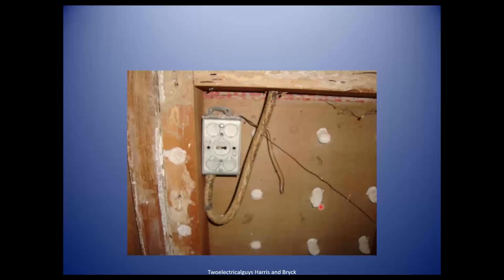This is plaster board — if you see these little gooey things coming out of the wall, it's called button board or rock lath. We know this is plaster, so this house was built after wood lath was used — look at the 1940s through 1960s, then drywall. When did grounding come into play? Right from the beginning — probably around 1962 or 1963. Even though it was part of the code, we won't see it used as much because it was so much effort.